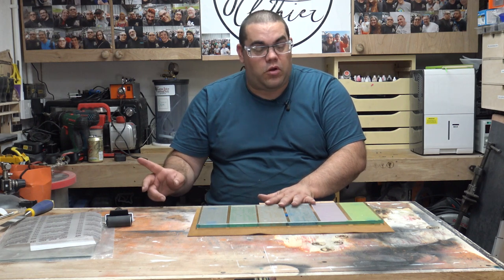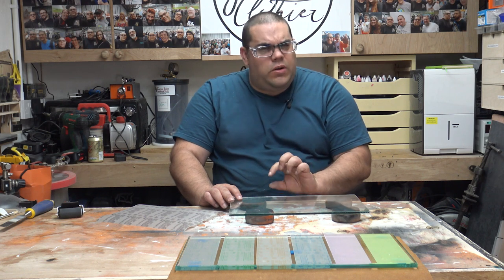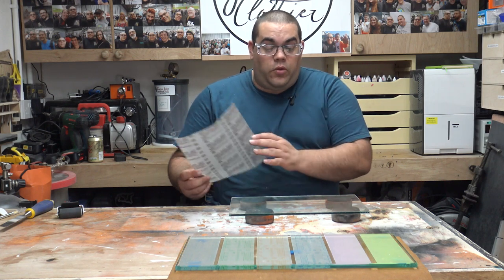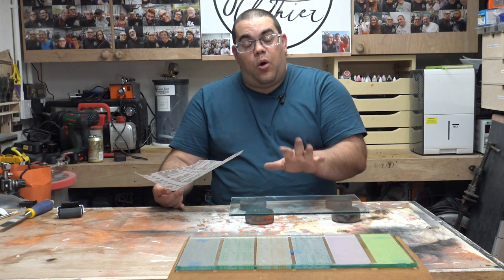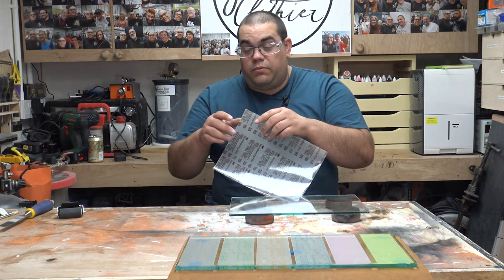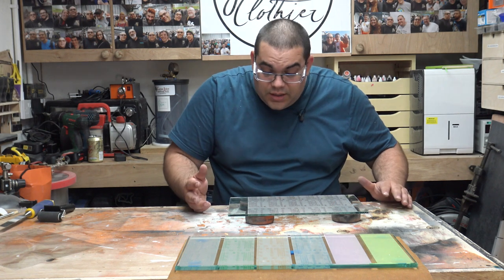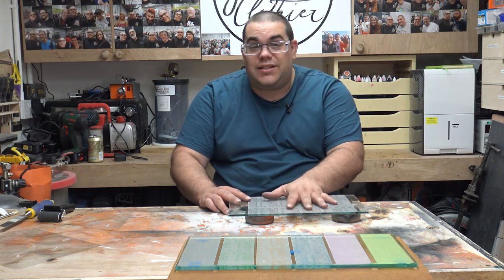I'm going to put this to one side now and go over to the 100 micron paper. I've got a different sheet of glass here — the Veritas one from Axminster. It's not as thick but it is still float glass, so it's still flat. Because it's got no rubber pads I've just put it on four bench cookies. The instructions say to put the whole sheet on the glass. I want to keep this separate because I also want to use it for flattening the bottom of planes. I found applying the full sheet a lot easier — maybe because it's bigger or a bit stiffer — and I've got no real bubbles in that.